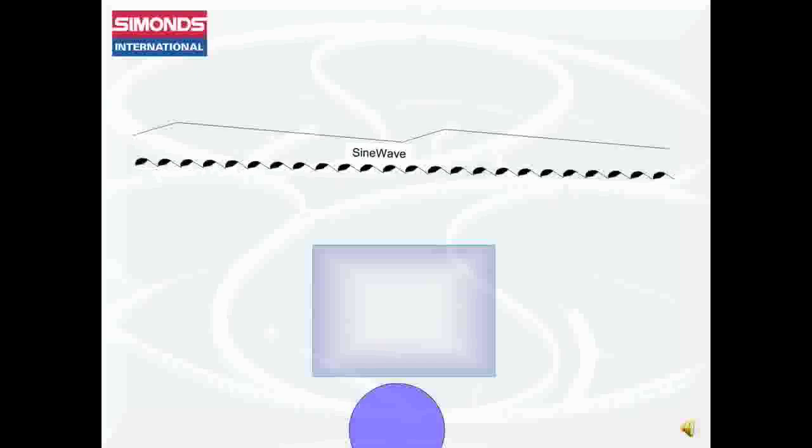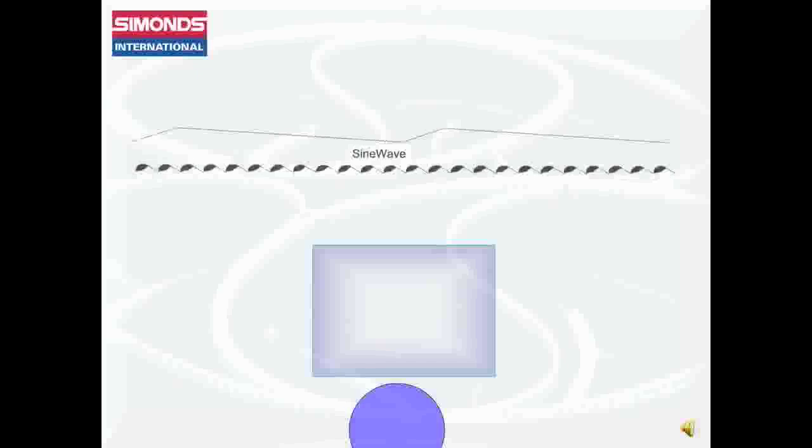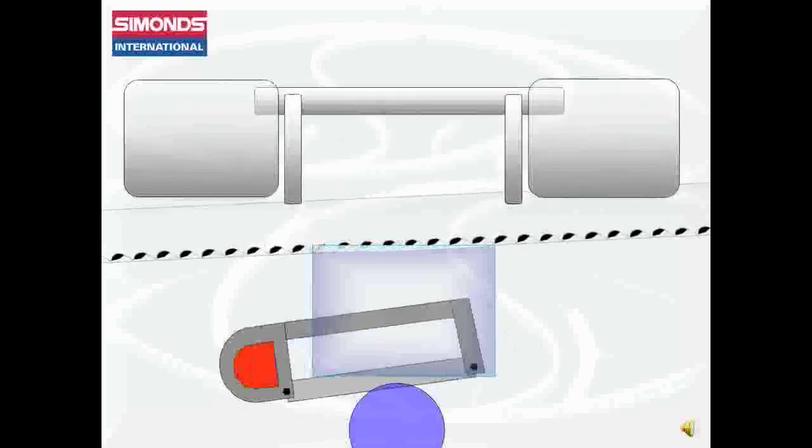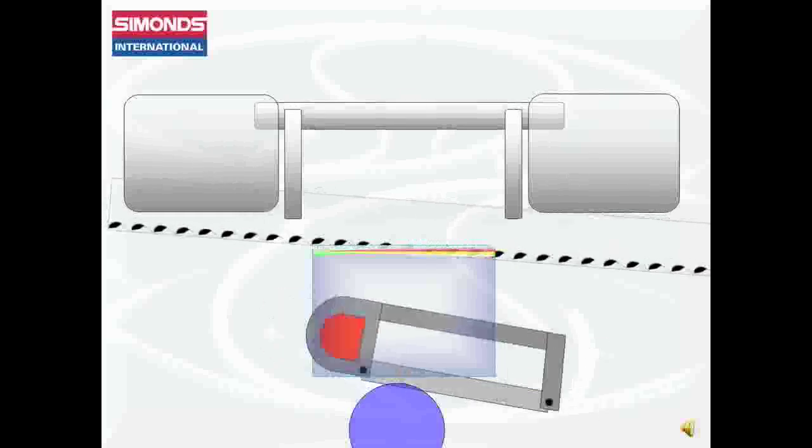We accomplish this by engineering a ramp onto the back of the blade that causes an oscillation as the blade runs against the machine guides. Like the hacksaw with the rocking motion, the bandsaw blade is always engaging the material with a small area of contact, allowing optimum penetration with minimum feed pressure. The result is a significantly faster cut and a longer lasting blade.